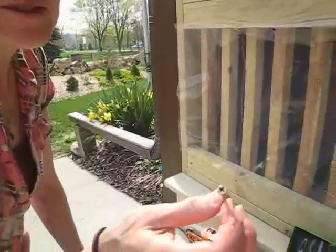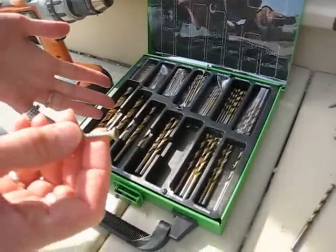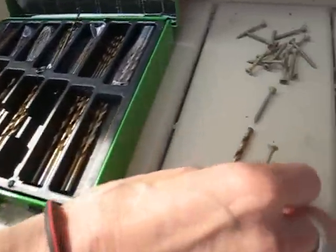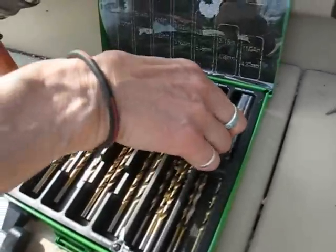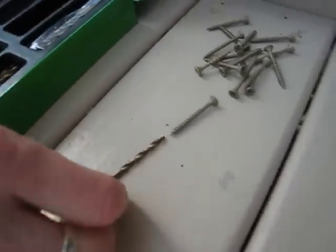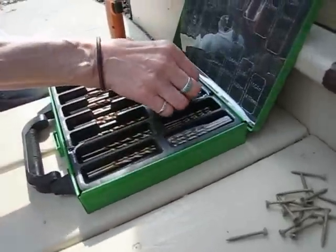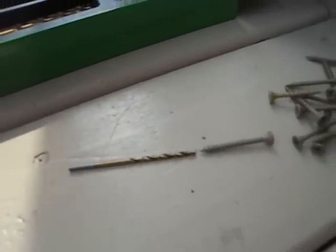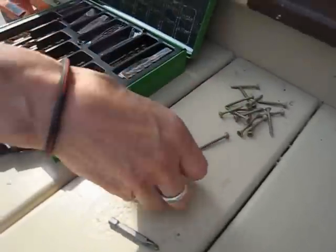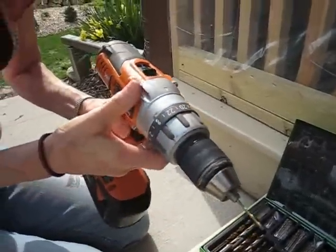I have the screw that's going to hold up my hanger — it's a deck screw, non-rusting. Now I need to pick what size drill bit to use. I want something a little bit smaller. This one is obviously way too big — you can see if you drill with it the screw would just slap around in there. This one, while it looks like it might be okay, is still so large there would be hardly any teeth to keep the screw in. I've decided on this one — it's definitely smaller, but it'll still make a nice path to get the screw in without a problem. I'm going to put it in my drill, tighten it up, and I'm ready to go.